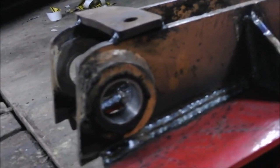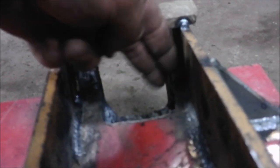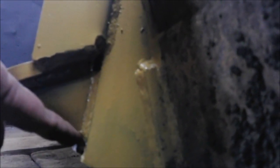See some of Al's welding here — stuff looks nice. Did a couple passes there, make sure everything's real strong, fully welded on the inside. The way we cut it, we ended up having to clearance this because the bottom of the arm comes through here, and up here as well the top of the arm has to fit through there. Here's the gusset plate — we just inset it so we can get a full weld here, full weld there. It's fully welded on the back side in both places — three sides — so nice strong gusset, that's on both sides.